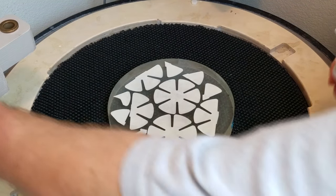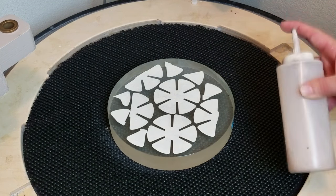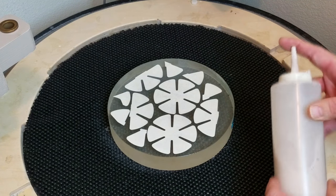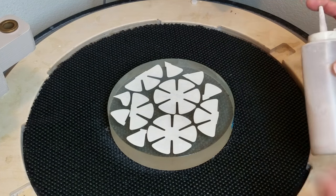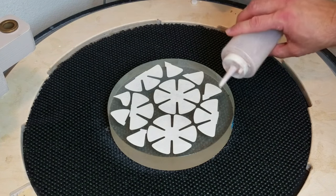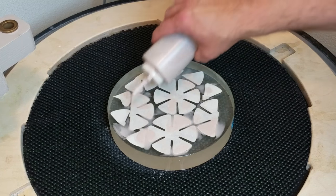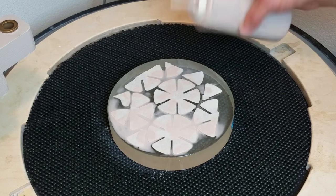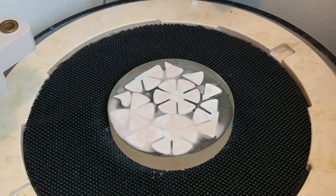In my shop I keep two grades of cerium oxide: a high-quality grade for final figuring, which gives the best surface quality on a pitch surface, and cheap cerium oxide for rough polishing and for things like working on the back of a mirror. You just want a little bit on each of the pads — don't worry about covering the whole thing. A few drops is all you need; make sure it's good and wet and you're ready to go.